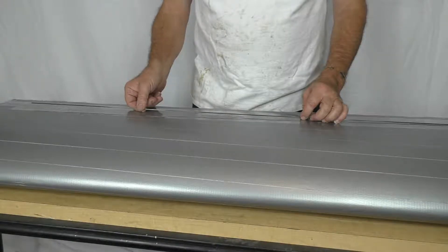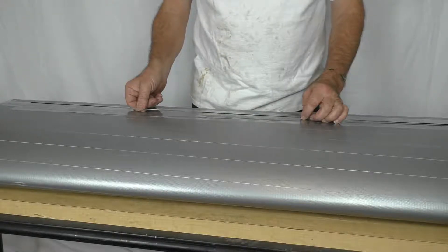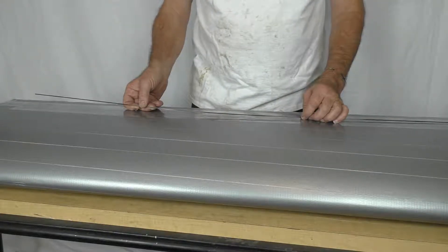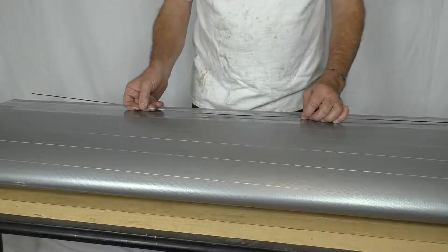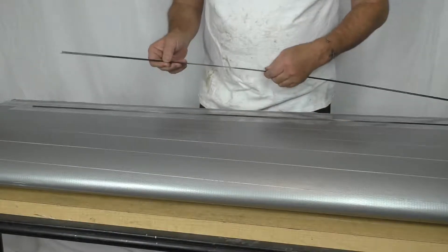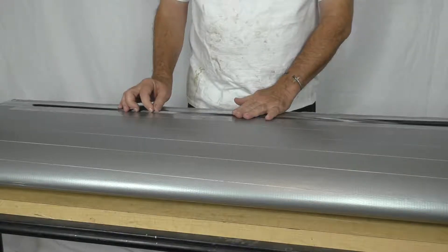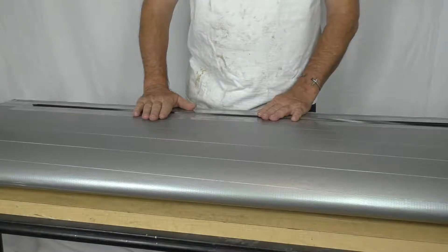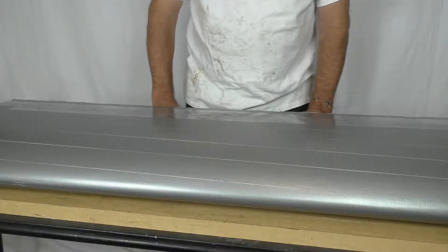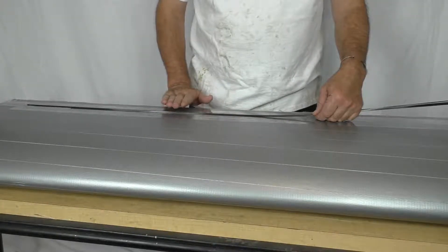They are cost effective — they're not inexpensive — but when you consider the labor involved in laying up unidirectional carbon fiber, this can be quite effective. These are also 40 to 50% stronger than any wet layup a home builder could do. What I'm going to do today is take five of these and bond them together into a package on the mold of the D-tube leading edge. Because the airfoil is curved top and bottom and angled relative to the main spar,